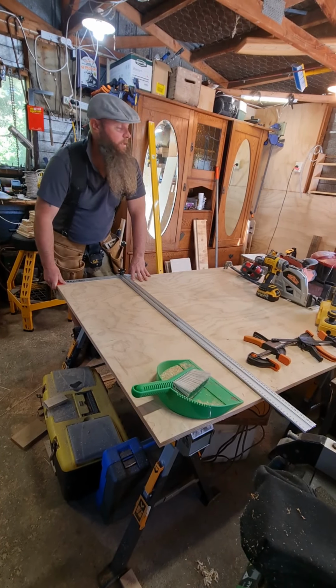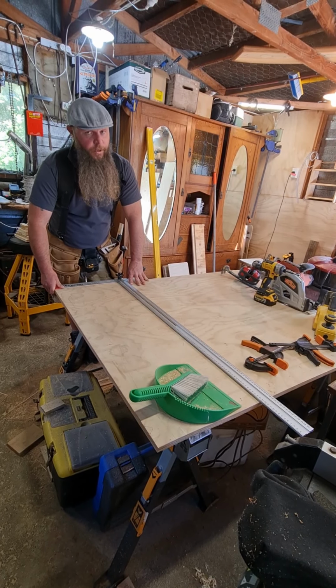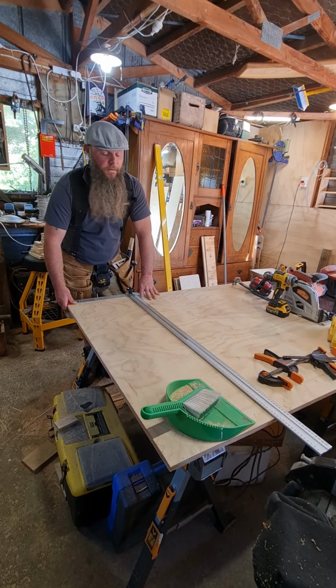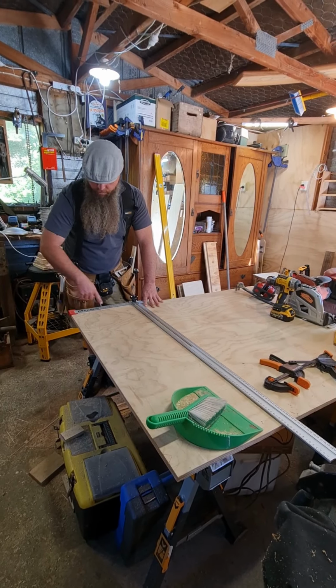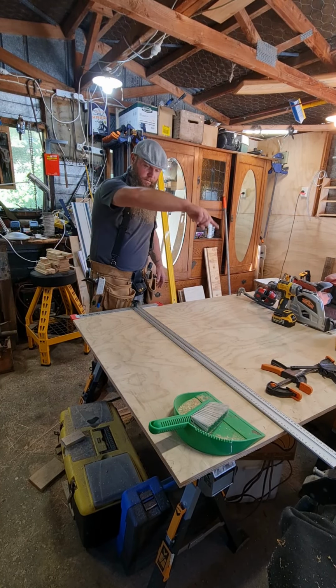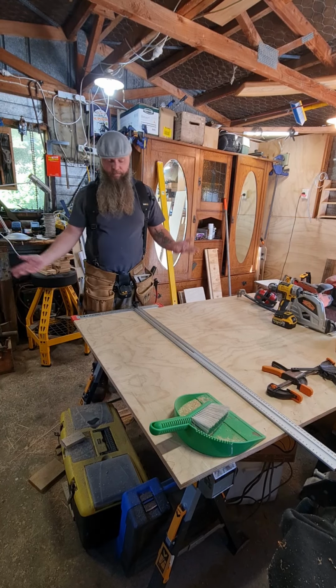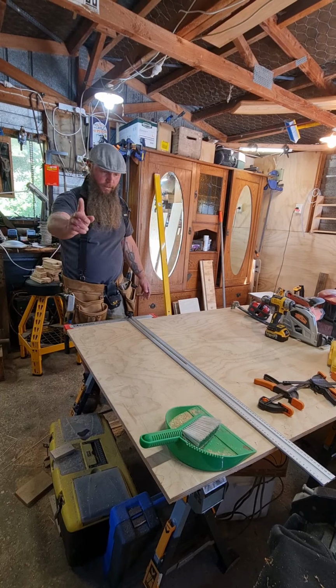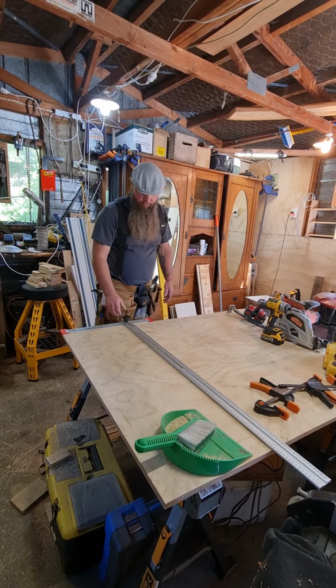Oh, I guess the problem is that those bits of plywood, they've all been used before for different projects. They've all got cuts in them, nothing square and straight. You might find the occasional edge which is square, you can work off that. Simply put the template on, trace it, cut it, perfect, easy. But if you have to square an edge up, T-square, mark it, and you cut it with the rail saw.